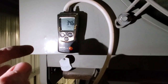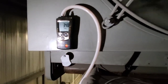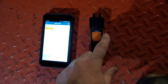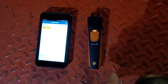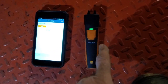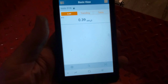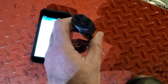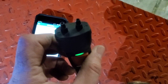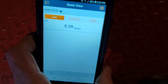We're going to use the 510i and the Smartprobes app to show you how to check it that way as well. To use the 510i, we need to be in the Smartprobes app, then turn on the tool. Once it connects up and is flashing green, it's connected. We're connected and we're going to zero that out, then attach the tubing again to the positive side, which is on the right-hand side of the tool.